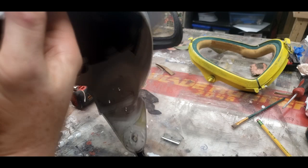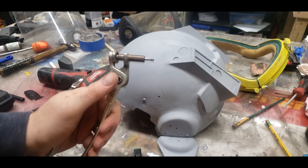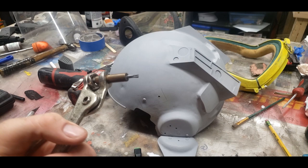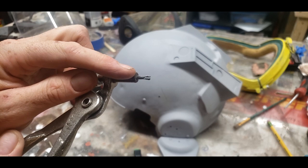Now, if like me, you've worked in aviation for the better part of 20 years, and you work sheet metal for a long time, or if you've worked in the sheet metal trade, you're gonna end up with a lot of different tools. And among those tools, you may have collected some clecos and cleco pliers, also known as spring clamps. These are used for holding two pieces of metal or material together through drill holes. You extend them out with these very specific pliers that really only have one use, and put them through the hole. Then as you release, the jaws widen out, clamping both parts together.